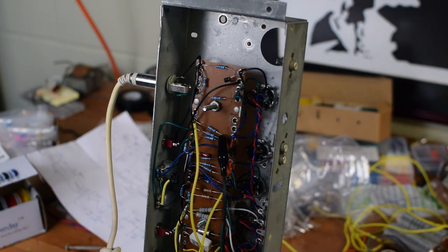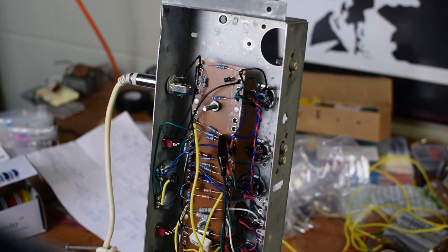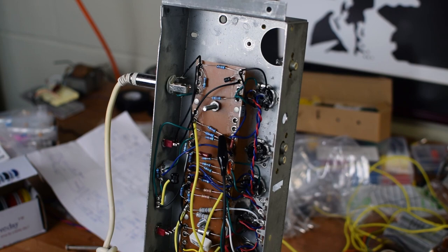So my plate voltage is extremely low. I'm uncertain if I have goofed up something. I checked, I had ground on the other side of my cathode bias wire, so I'm not sure why my plate voltage is so low. Maybe it's because I'm running the two gain stages in parallel. I guess we will maybe try lifting one of those blue wires out, see what happens. Maybe I'll take it to the forum too with a question. So, little snafu on startup.